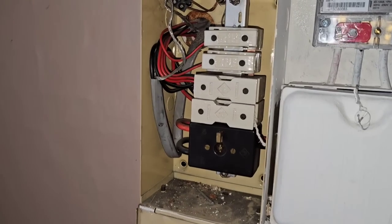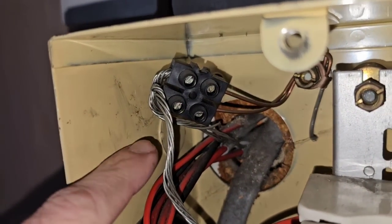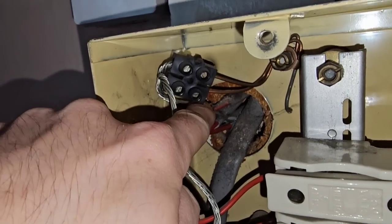Now this is where we need to age things. The CPCs are actually present on all of the conductors — that earth is on the lighting cable. This is different from my other video where there was no CPC on the lights. As I said in that video, CPCs became mandatory at every point in 1966, so I know this installation is perhaps around that age. I would say late 60s — 1966, 1967 — that kind of era.